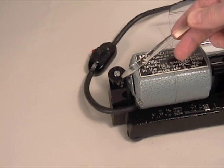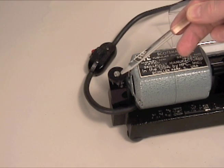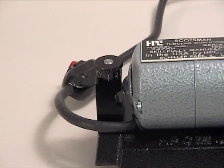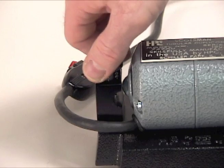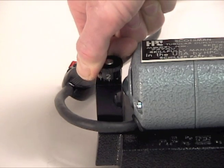To maintain perfect alignment, the elevation knob makes minute adjustments to the angle of the cutter based on the size of the key to be cut. Use the elevation knob to select the proper elevation for the key. For extension 1 small bore, select 1. For extension 2 standard, select 2.